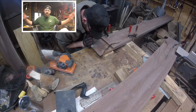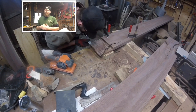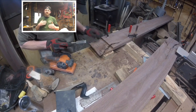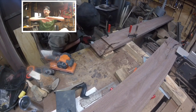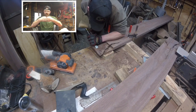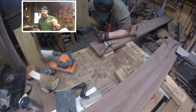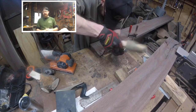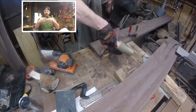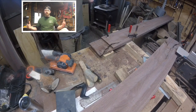The room is 13 feet long and I need a 13-foot shelf, but if I tried to bring a single piece in, it would hit the walls and just not work. So what I engineered here is a four-piece shelf where everything overlaps — the joints meet up and we bolt it together, using black walnut plugs to hide the holes. You can see the crack on that piece of walnut; it was a bookmatch piece so the cracks came together and I filled them with epoxy, sanded it all down, and that was pretty much it for the shelf.